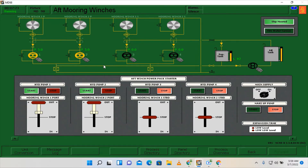We are already finished with the heaving out operation of the lines. We can now start to heave it in. To do that, I need to put it in the stop position and then put it on the heaving in position. We are going to do this for both the aft and forward mooring winches. Now we are going to start rotating in the reverse direction.